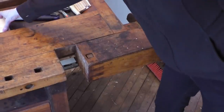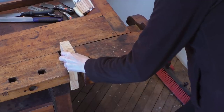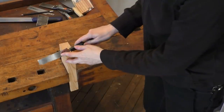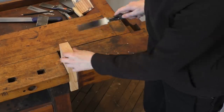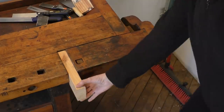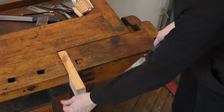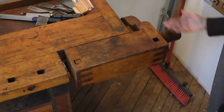The end vise is very versatile — it's probably the most useful vise in the bench. It'll hold down a flat piece very sturdily and you can use it for cutting and chiseling objects where you need to work on the ends. It'll also hold a piece of wood really securely so you can do trimming and working on the sides. I use it more than the side vise for most things.